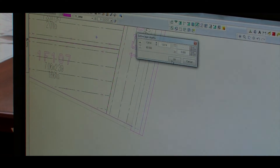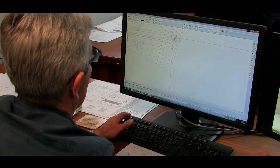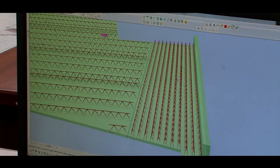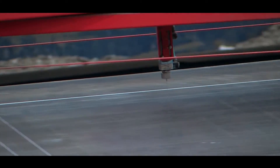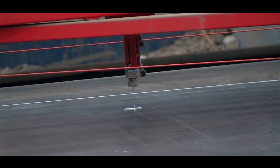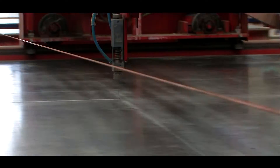The process starts with the design stage, and once completed, the CAD drawings are fed to a computer-controlled plotter that accurately paints the layout of the formwork onto the bed. It has a really sharp needle on it which will plot out about a 3mm line with paint.